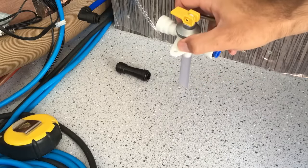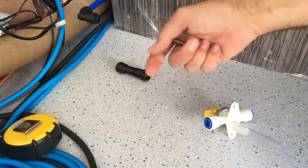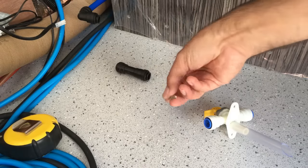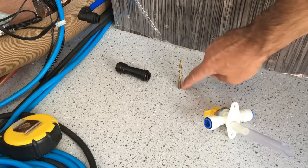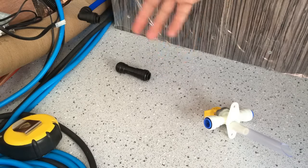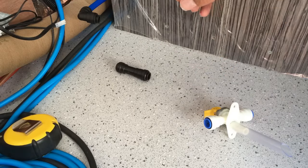This plastic hose needs to go through the floor of the van — I need to drill about an 18mm hole. What I find best when drilling holes in the bottom of your van is to do it from underneath: find the best location, use a small high speed steel bit and drill a pilot hole coming up from underneath. I've done that already. Now I'm going to drill it from above, gradually going up in sizes — maybe 9mm first and then creeping up to 18mm — rather than trying to chew off too much material in one go.